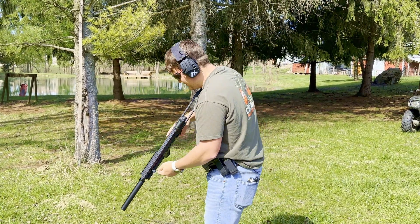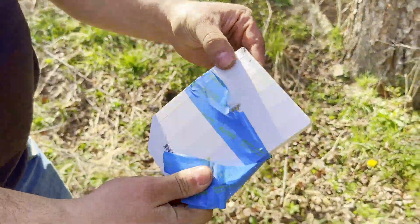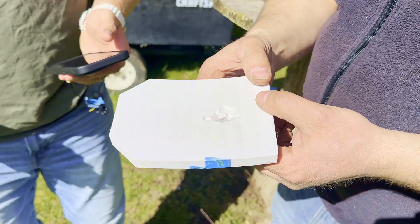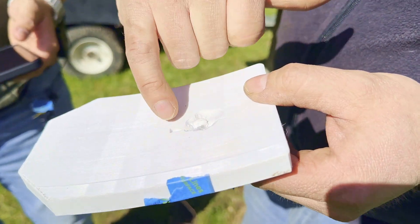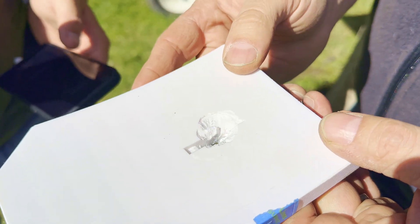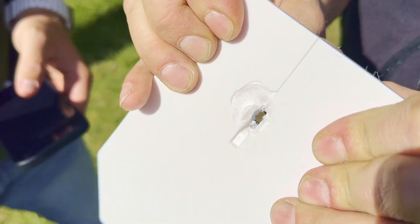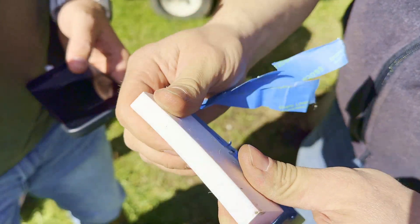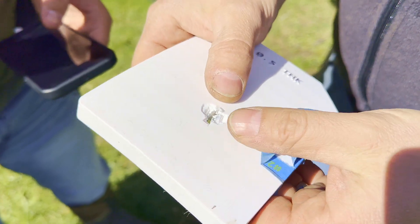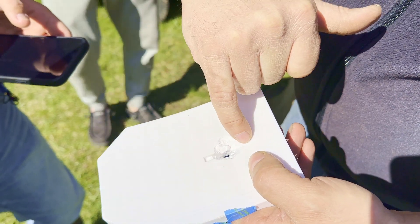It went through. That's kind of surprising — I thought that might stop it. It seems like the round penetrated so deep and then it sheared out a few of the layers. You can kind of see it's chipped that out. If you try to bend it, there's a fracture line you can see — there's a little delamination there. Kind of minor damage on the front side, because they were printed on the side orientation. There's definitely a fracture on this side here.